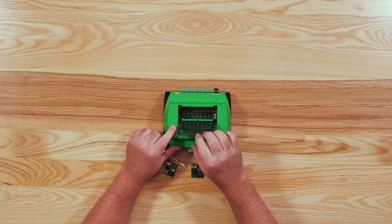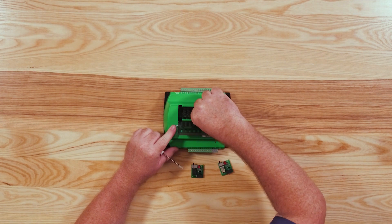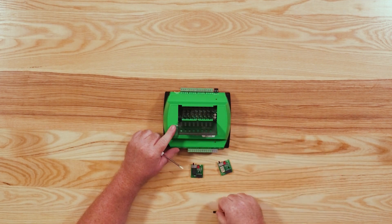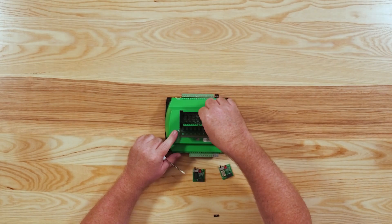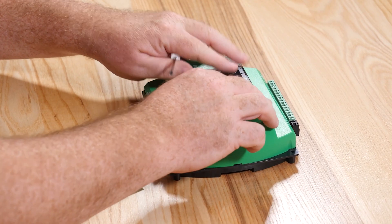Let's start by looking at how to wire the controller using the 6701 triac card. First, make sure the controller is not powered. Open the cover panel and remove the jumper associated with your output. Remember, if you're not going to use an override board, the jumper should always be in place, so now is a good time to make sure all the others are securely seated. Once the jumper is removed, slide the card into the slot corresponding with your output — in this case, inserting our triac board into the fifth slot corresponding with universal output 5 directly above.